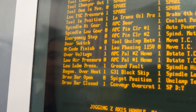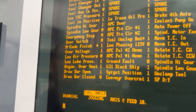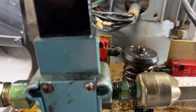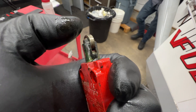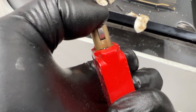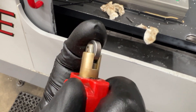See how they both are at one — they shouldn't be like that. They should be opposites, and eventually it turns to zero. That's the issue. So this one right here is super slow — this is the switch in question. See how slow that moves out — it's all sticky. I cleaned it up, threw some WD-40 in there, then cleaned it out with IPA. It's super fast now.